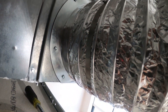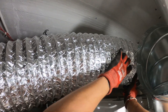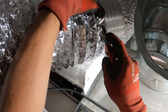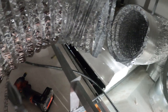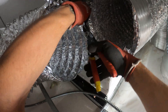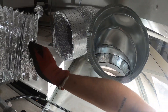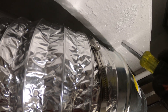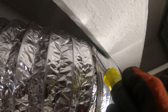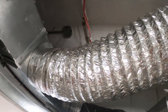I taped the edges, got a good strap. From here we just need to fit it to the elbow and cut it. I'm going to cut this and then the last metal piece, cut it with the snips. We're going to run this right into here. I'll put the ring on and just neatly bring this in. Everything's in. From here, got the ring, just going to tighten it down. Going to tape out the edges and we're good to go.